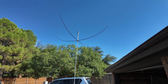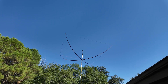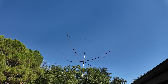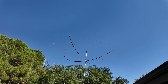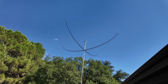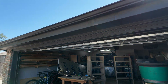Here in my driveway I set up my 10 meter three-element beam. This is a portable antenna that is really quick to set up — I can usually get it up in the air in about five minutes. It's got a dipole in the center and then a director and reflector, and it supposedly has about 12.5 dBi of gain. That seems to work really well for me when 10 meters is open, and I guess that's why I'm really excited that it's finally opening up. I should have been working on these bookcases in my messy garage today, but I've been working on that project for a while — I can wait another day.